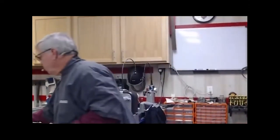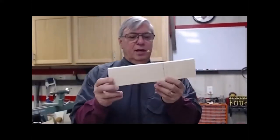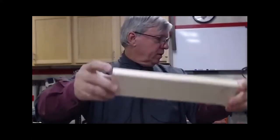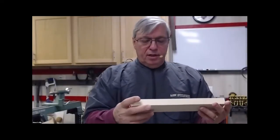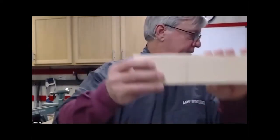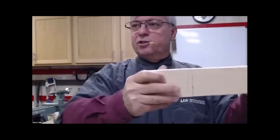Okay, what I wanted to do was use 1-inch boards like this one. I wanted to be able to mount it on the lathe, and when it's going around the lathe, I wanted to be able to hollow it out, just the way you'd hollow a hollow form or a vase or something. But that brings two problems. One is, how do you mount this on the lathe where it's going to be a ways away from the head and you hollow it from the end so that it doesn't vibrate, so it's on there solid?